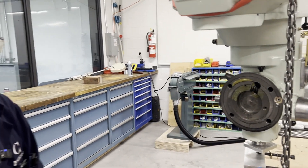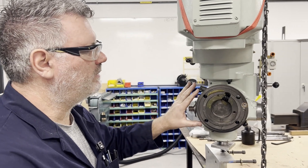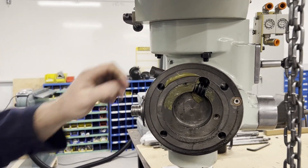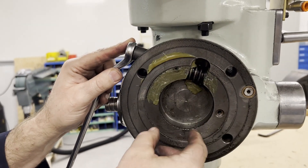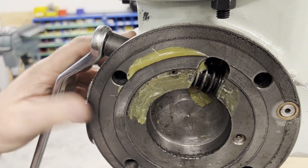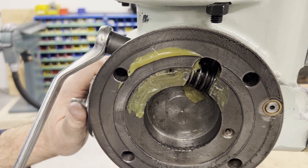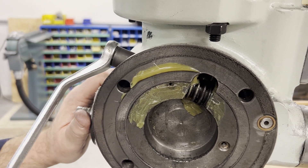I have the milling machine head supported from a chain fall and we have access to the back side of the mount. This machine surface mounts to the column — this is the back side of the adjuster. When you adjust it, it turns the worm and that worm crawls along the pinion gear on the base of the machine. You can see if I turn the adjuster screw the worm is stationary, because it was adjusted without the locks being unlocked and the operator overpowered the adjuster and twisted it off.